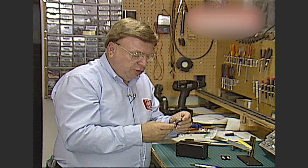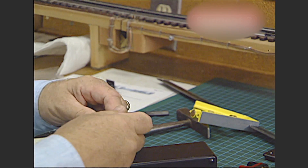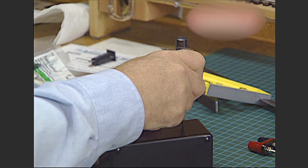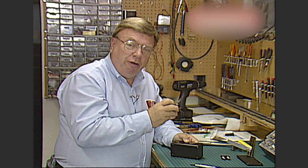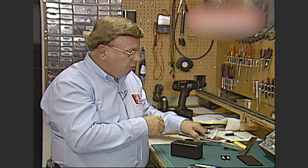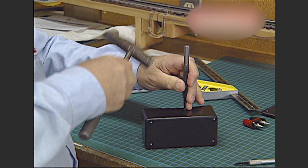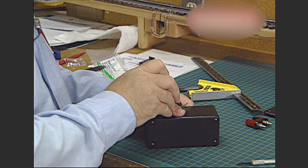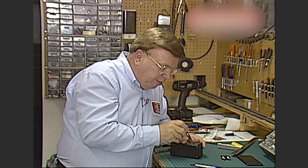If you don't already own this tool, this would be a nice one to put into your inventory — a spring-loaded center punch, perfect for this job. You need to make a mark on the plastic right in between those two ghost line ribs and right on your line where you're going to drill. It's very easy to hold and use, and it makes a nice mark for the drill bit to follow.